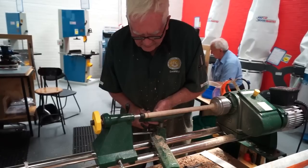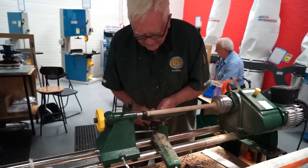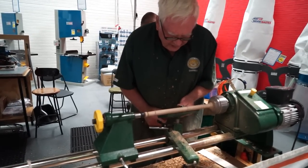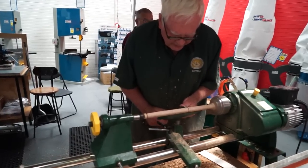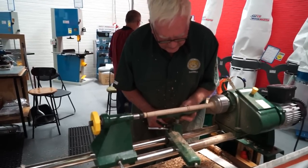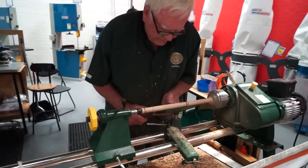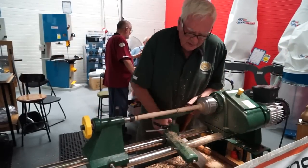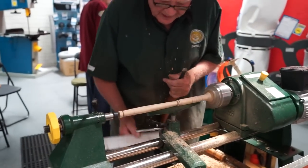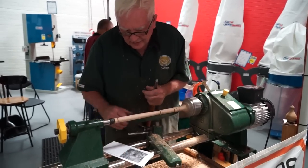Now that's got to be slightly tapered down. Come up to the bead — V cut, widening cut, and again. Roll the bead. Now taper it back to the bottom of the bead. For a reminder you can go back to your pencil gauge to make sure you're getting the right cuts in the right place. Refer back to my picture for the shape of the thistle.